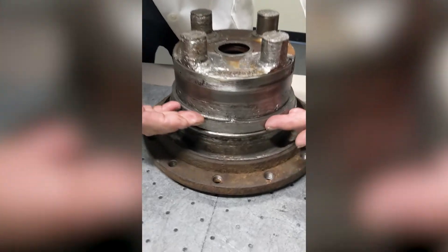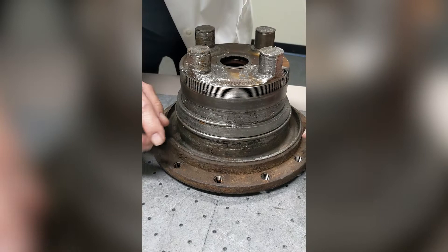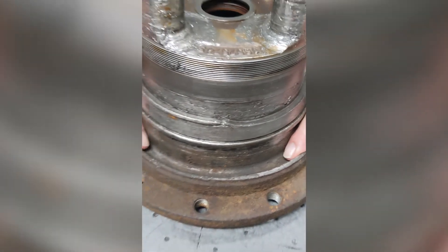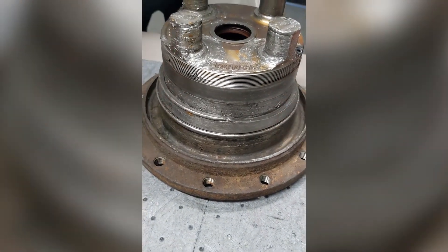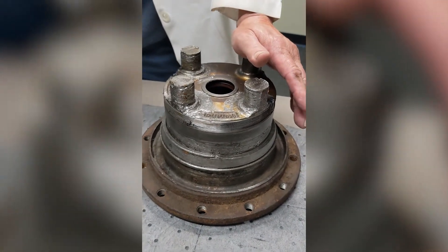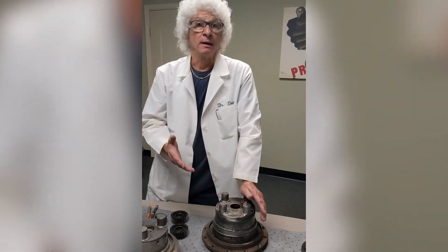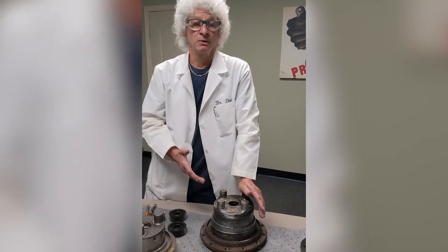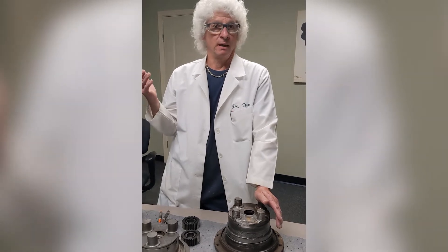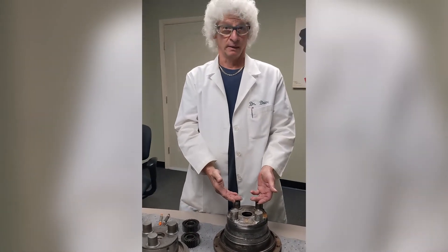The other part down here on our main bearings — here's one of our main bearing races, our two main bearings, and the other item is our face seals. The damage just keeps on going. The cause of the damage is driving your machine when it's got a lubrication problem. It hasn't been serviced, or you don't hear the noise — we know you drive it till it stops. You've got a job to do, and this is the condition that comes in.